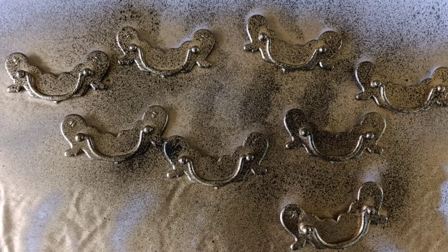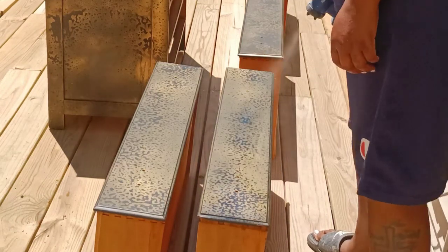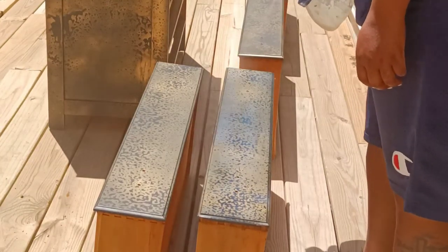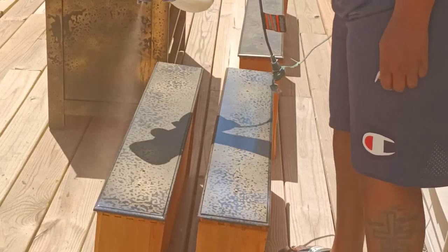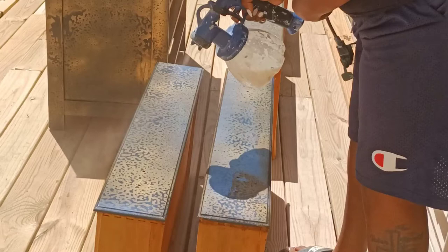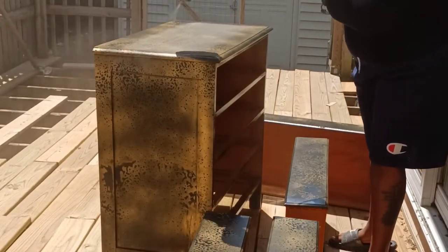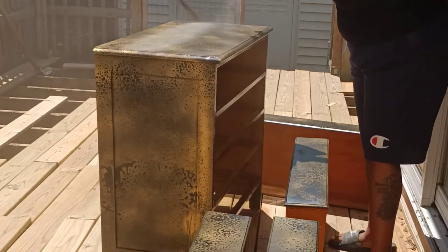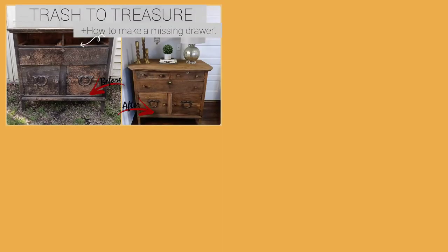I had a mostly empty can of black spray paint and so since I knew it would sputter when I went to spray it, I decided to let that work in my favor for the hardware — I let it just sputter out over these and I think it gave a really cool effect. Here is the top coat that I am using — a clear gloss. I was kind of nervous because typically when I use polycrylic over black paint I like to add some of the paint in, however I could not do that because I did not want to mess up my gold paint. Since this piece was leaning really edgy I thought the glossy top coat would really set it off. I am using my HomeRight spray gun which I really love to use for my top coats — it is a huge time saver and top coating this whole thing literally took me about two minutes per coat.